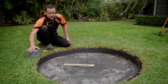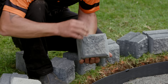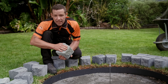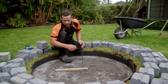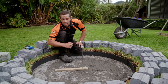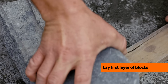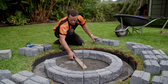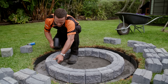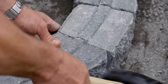We're on to starting to lay our blocks now. We have our standard tongue and groove style — groove on this side, tongue on that side, and these all slot together. We also have our groove on one side and smooth on the other; that's our top layer, so we'll be putting that on last. I've got a bit of timber here as a guide — 375 millimeters, which is the radius from the center of the hole to the inside line of our blocks. It is 20 blocks per ring. I'll start laying those in and use my rubber mallet to adjust them nice and tight, making sure they're sitting flush with each other on top. The rubber mallet lets you hit them quite hard without breaking or chipping them.